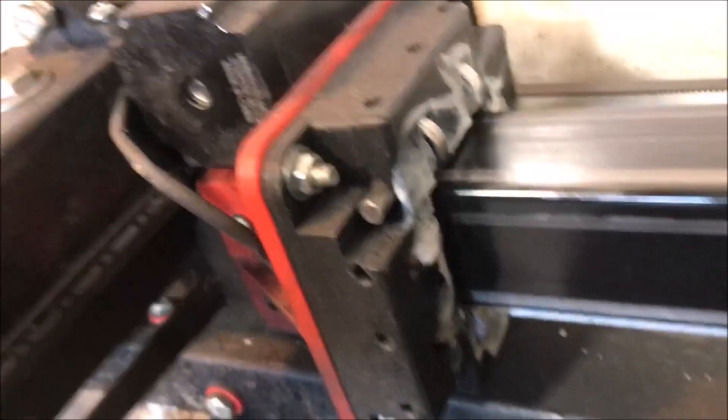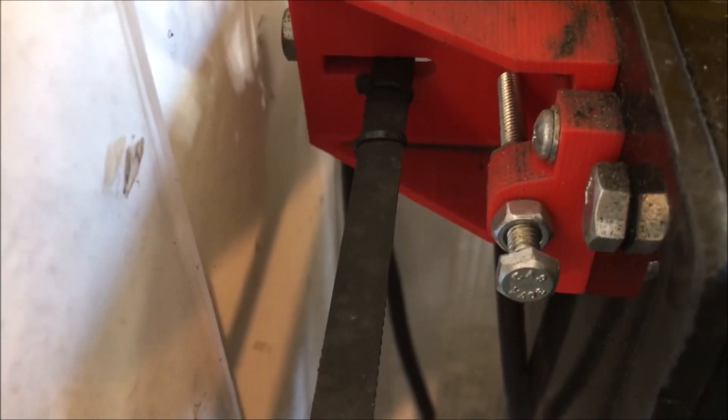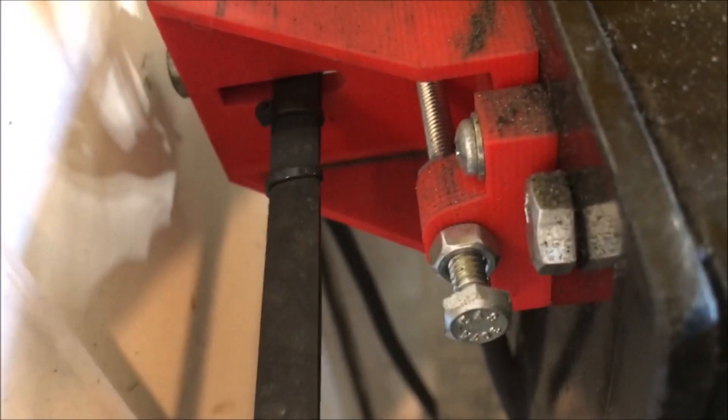They tend to get a lot of dust in them - you can see what I mean, this stuff gets on everything. Even my ground down here is just full of that metal dust. So a good chance those bearings just need to be all pulled and replaced. And in fact, this piece right here - I could not get that to go back in tight because as you can see it was kind of split at one point. So the bottom two are tight but the top one is not. I need to get back in there and adjust that. I'm going to loosen it, undo those two wire ties, try to pull them up as tight as I can, and then tighten this back up.